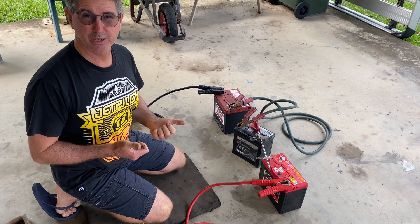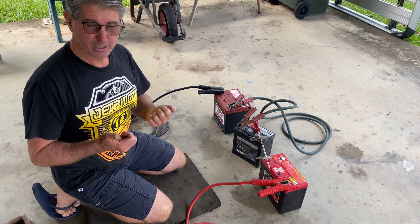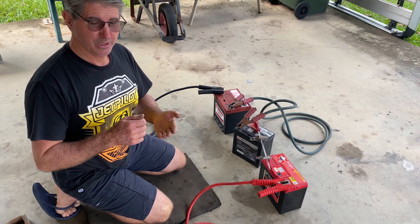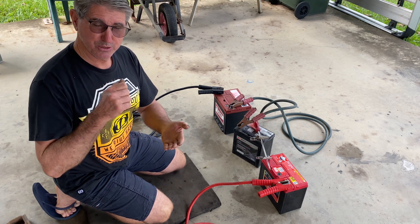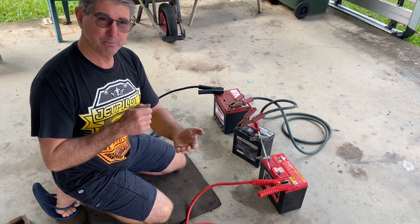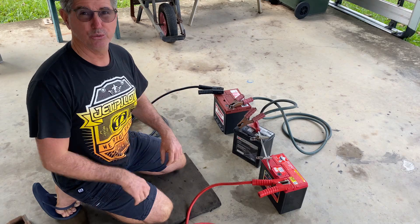Now we're ready to grab a welding rod. A couple bits of steel and I'll just show you how to weld. It'll burn a pretty good weld, but if you just tap it, do a big tack, let it go, tap it, do a big tap, let it go — it allows your batteries and your leads to cool down.